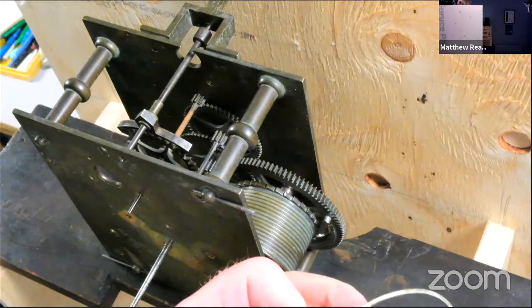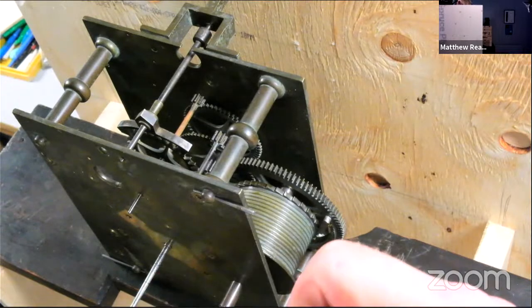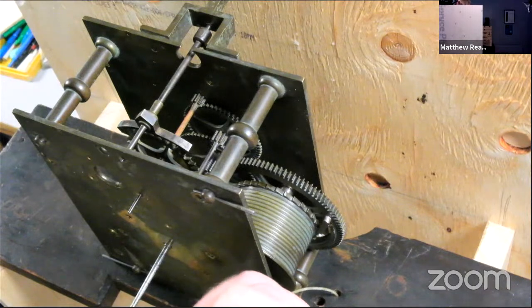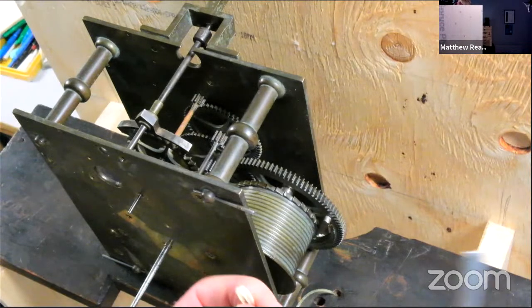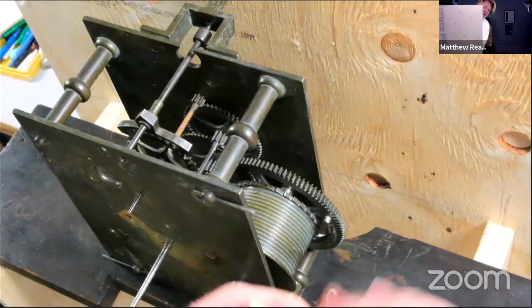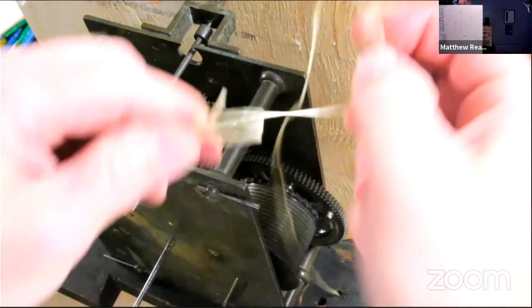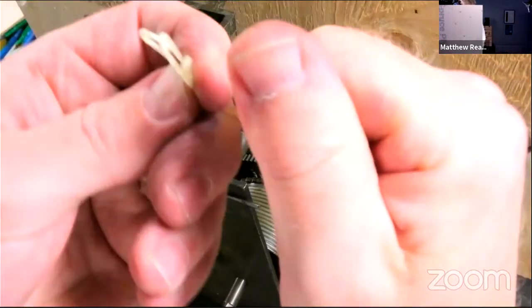If you can help it, when you're doing these butterfly knots, when you're putting lines on long case clocks, please try and avoid bits of dowel, nuts, little bits of brass rod with holes drilled in them. In my humble opinion, just do it like this. Need to end this, of course. Maybe you'll have a little bit more time. It's just a really nice way of doing it. So can't quite see what you can see. Like that. Right. There's our butterfly knot. That's good.